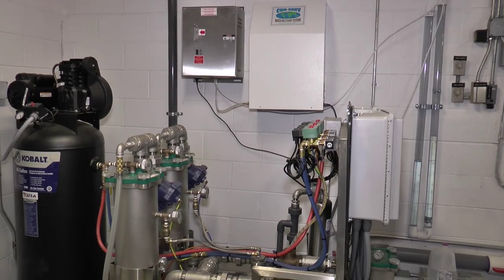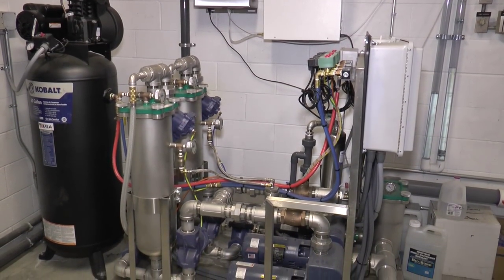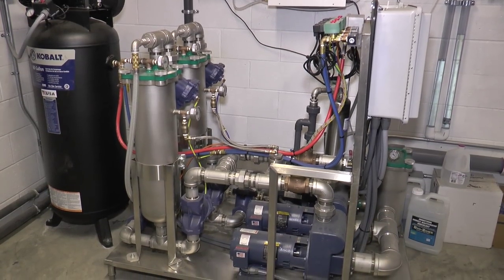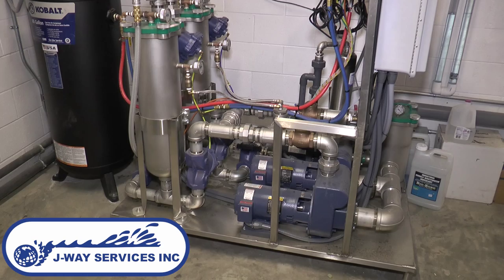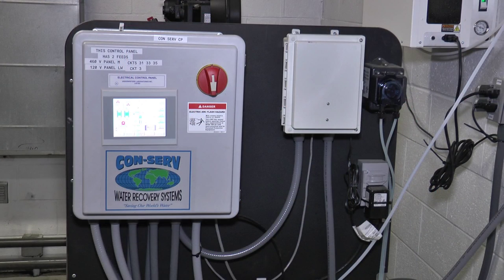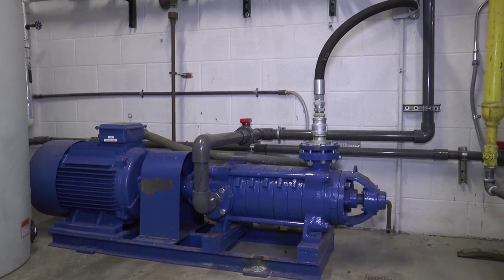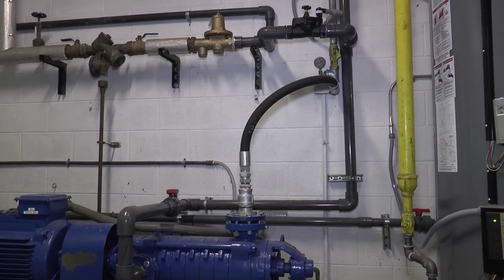This reclaimed unit is made of all stainless steel, is guaranteed for five years, and needs no attendant because it is self-cleaning. It will clean the reclaimed water down to the size of a white blood cell. It is recirculated in the three outside tanks 24 hours per day, seven days a week. This pump sends the reclaimed water to the second arch at 400 PSI and 100 GPM.